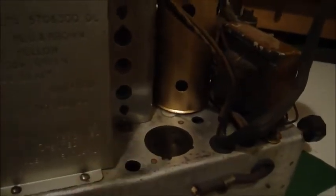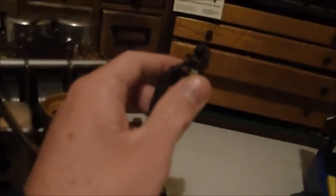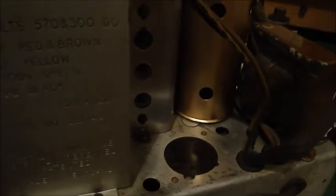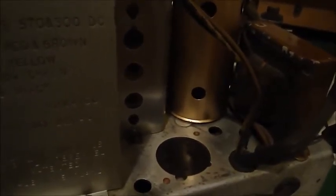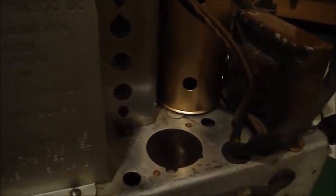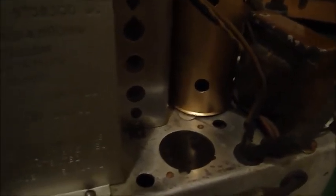This is the only valve that's missing. The valve that goes here — we've also removed that. That's the Magic Eye tuner position. This is the output valve position; what I'm looking for is a KT-42. When I removed it, it rattles terribly — you move it about and you can hear everything rattling around inside. Plus it had electrical tape around it, which is a big no-no. I've ordered a new one.